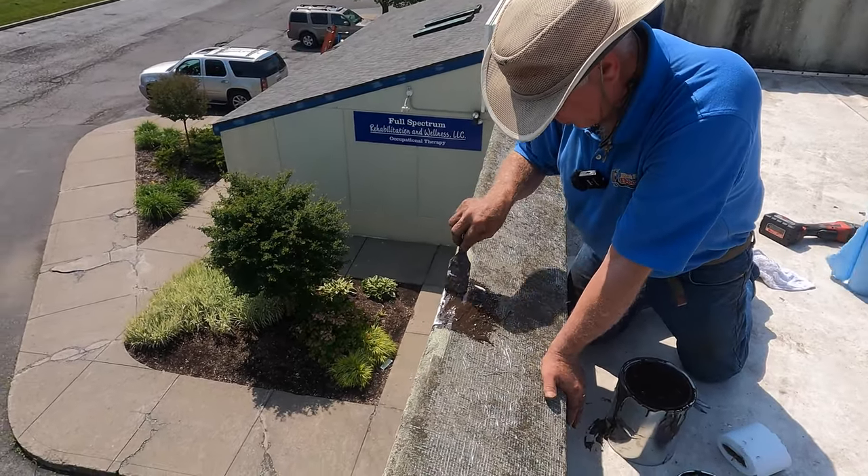This will save you thousands of dollars because you don't have to restucco your building — just fix the corner at the very top of the wall. One of them they took all the way up — I did not see that, but here it's wet. Something is getting in here and it's loose. Cut the fleece in half and put it over because this is going underneath the drip edge.